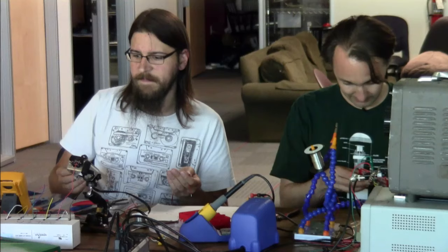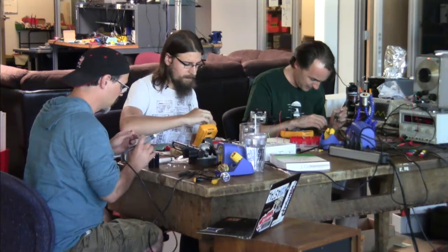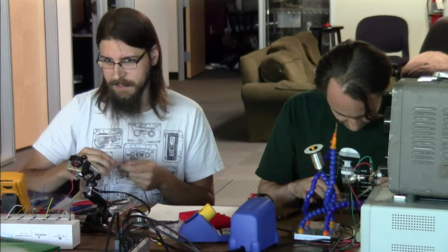And if you do that, you're kind of capable of doing more of a weld type action where you can stack the solder up and flow it from one location to another, if that makes any sense. Or if you've got some of this proto board and you want to bridge a whole bunch of things together, turn your soldering iron down and it doesn't flow so much. But otherwise, I kind of leave it on 750. If it's really big parts, I'll kick it up to 850. Ground planes are particularly bad because they act like heat sinks and take all your heat away.